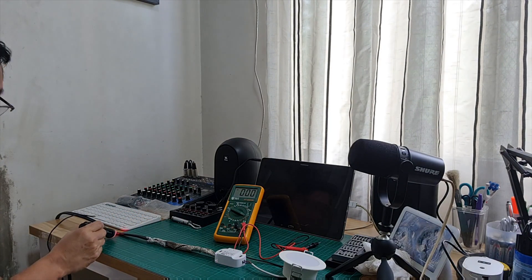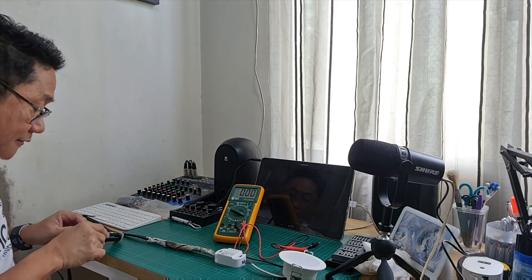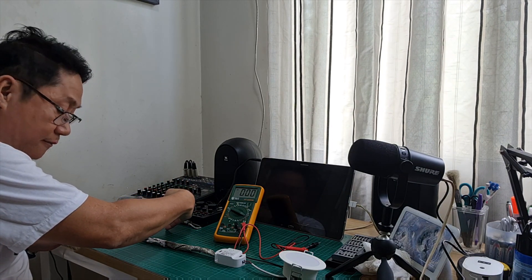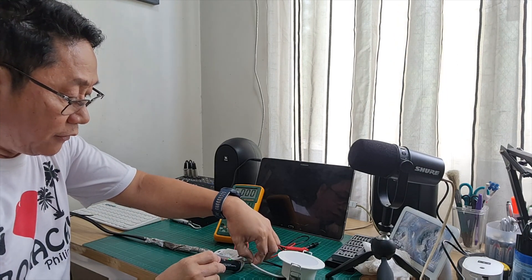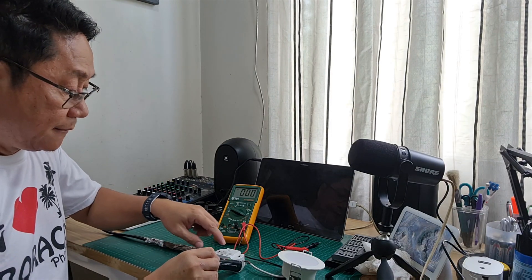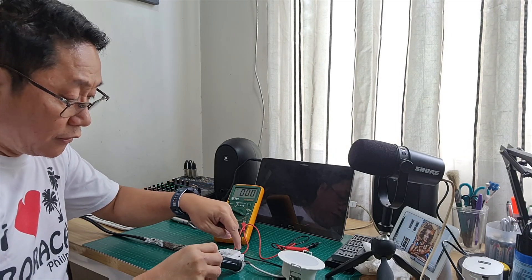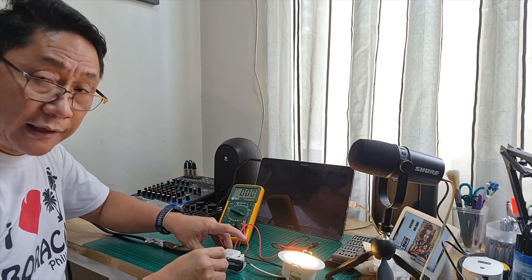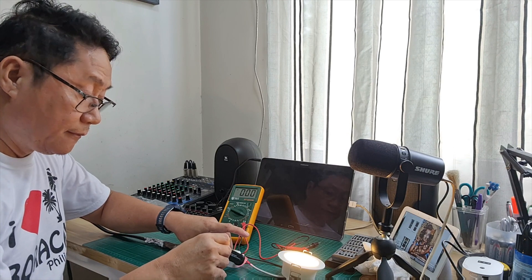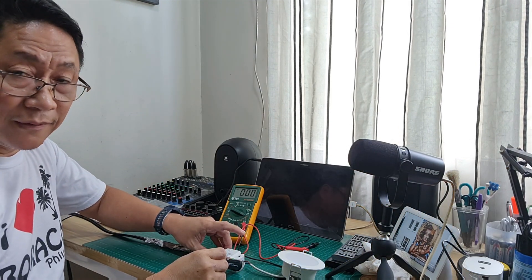For example, look at this portion. This area on my side — close to me — is the neutral line, and the other side is the hot line. So the stronger voltage is on the hot side. Here is neutral; on the other side, the detector beeps faster. When I turn on the switch — watch — I'm pointing at the neutral side, then on the output line of the smart switch going to the lamp, pointing at the neutral line. Now I'll turn it on — that's the neutral side. On the hot side, the sound gets louder and faster. When I turn it off, no reading either.